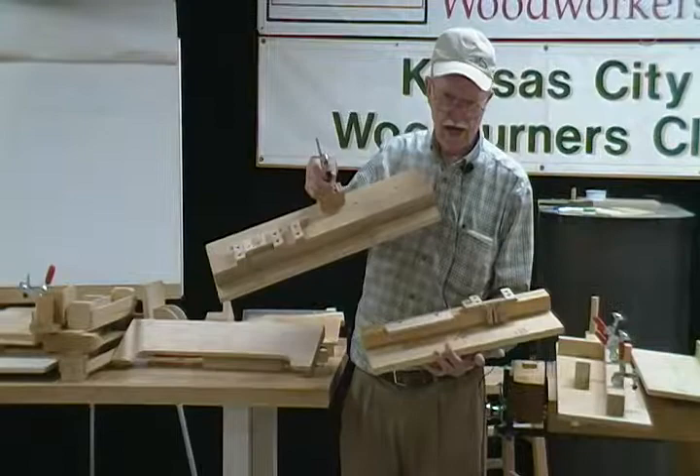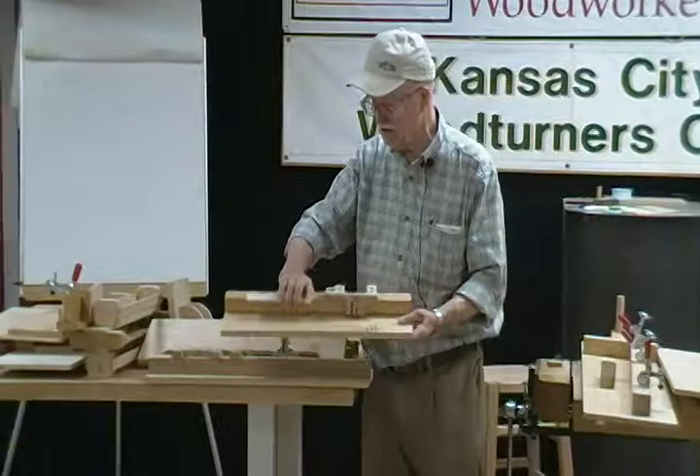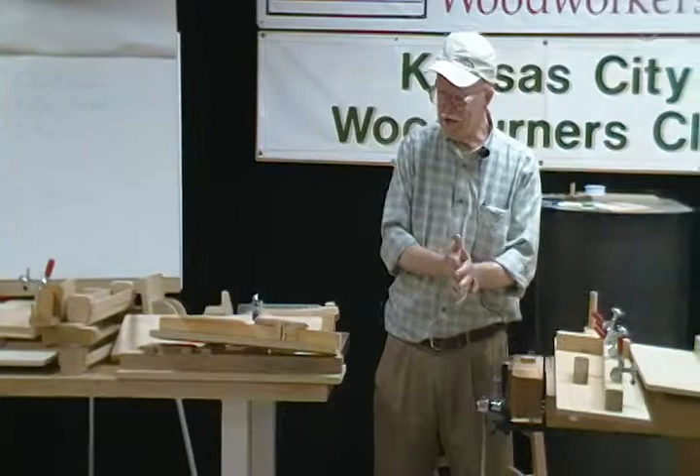This is exactly the same setup for the axle holes on the truck. This was Norman's idea — he's got marked on here what model trucks you're making and which flip stops to use. We've got them labeled A, B, C, and D. It makes the jig kind of foolproof. That's a toy drilling jig.